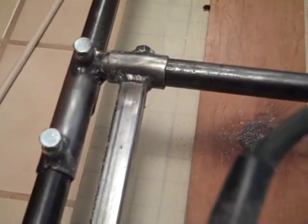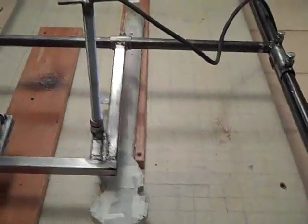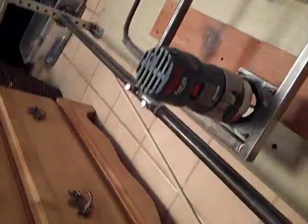On the y-axis I've got little bolts and nuts to lock it down if I ever want to, same here. I also have another feature underneath: a threaded rod that connects to the y-axis position movement. If I turn this handle, it moves the whole thing forwards or backwards. I've got it connected with a chain back there — you can kind of see it — a couple of gears, and that allows the two sides to move in the same position at the same rate.